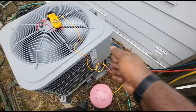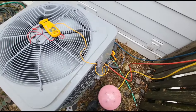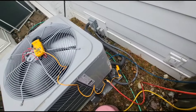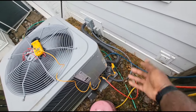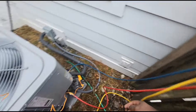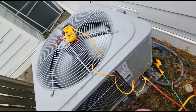Sometimes you can get lucky and it'll be an obvious sound, but sometimes you might get a good two or three hours of taking everything apart. Isolate every single thing you can. As far as that suction line service valve — all I had to do was crack it with an allen key towards the left. Remember, left is open, right is pumping it down — closing it. It was already open but I just had to crack it a little bit more to the left because it was leaking. Freaky things do happen on installs — sometimes the suction valve can leak and all you gotta do is turn it not even a quarter turn to the left. That was an interesting find. Always be patient and never get fixated on a certain area — by zoning in on the line set, I should have checked the valves first when I got out here. You live and learn.